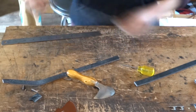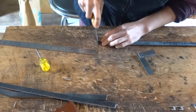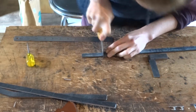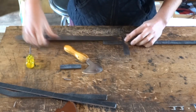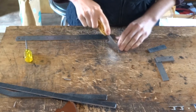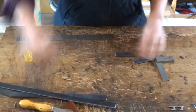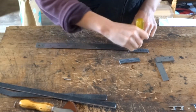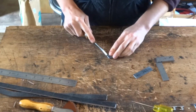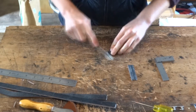We're now actually going to make the platforms for our billet. So you want to cut 2 2.5 inch long strips and then just nick the corners of these so they're not sharp. And we're now going to mark 1 1/8 in from one end, and that will be the oval hole. And once you've done that, you can now edge number 1 both of the grain sides of your platforms.